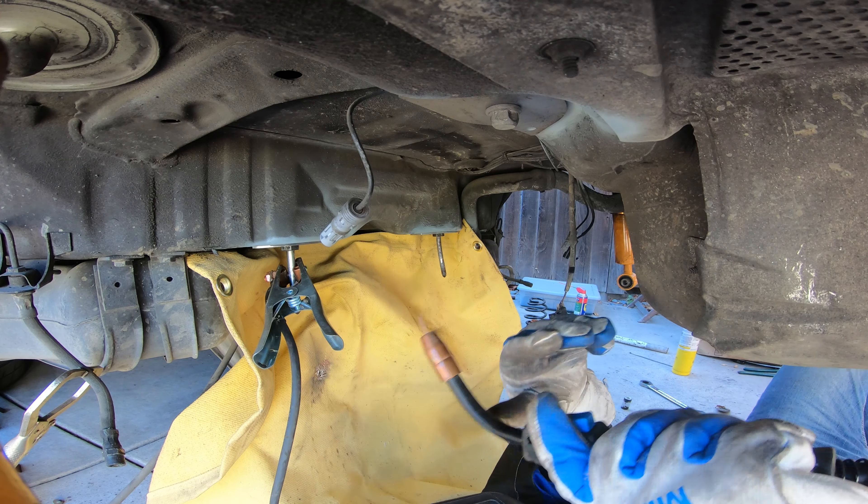Now doing the R-tabs — the rear lower control arm reinforcements. These little pockets right here have an issue with mostly rusting out and getting old. What you have to do is weld in a reinforcement plate. Let me show you how this thing works.